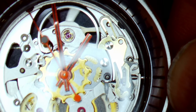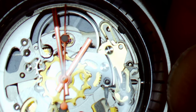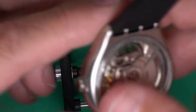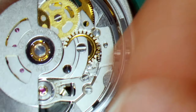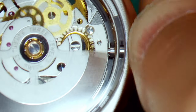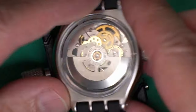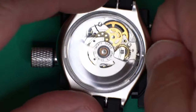It's also fun to see the balance wheel and escapement working. On the back, when we're in winding mode this gear is engaged right under here, so it turns all these winding gears. The gear that the rotor turns is this little pair — so you can see all that winding stuff happening.